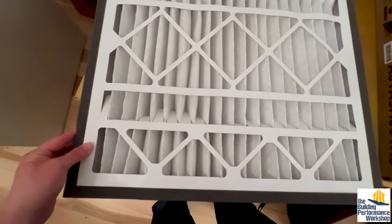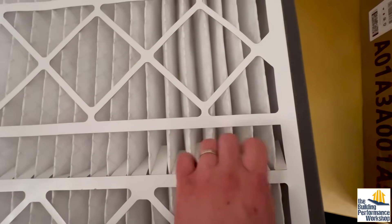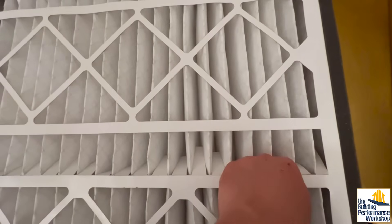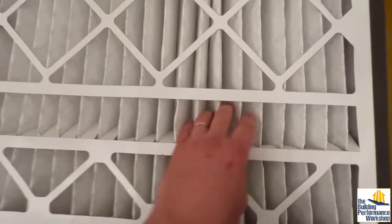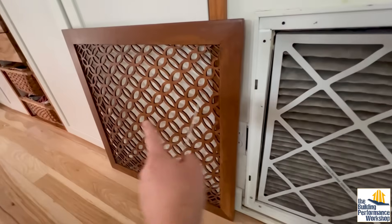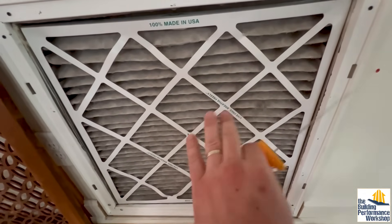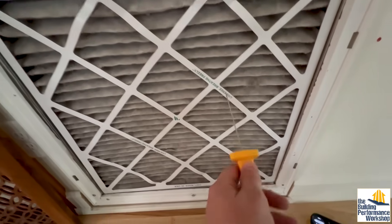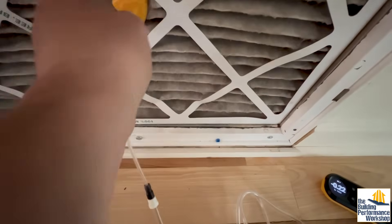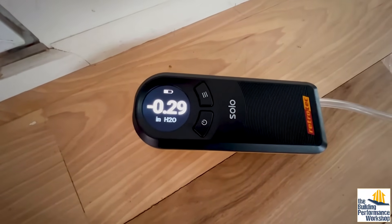The filters just arrived. The foam looks like it's well glued, but the spacers inside are a little bit off, so you'll probably want to spend a few minutes making sure all of those are absolutely perfect so that the air actually goes through and doesn't get deflected around it. I'm going to take the grill off our central return and test the static pressure behind the existing dirty filter by poking a pressure probe through it.